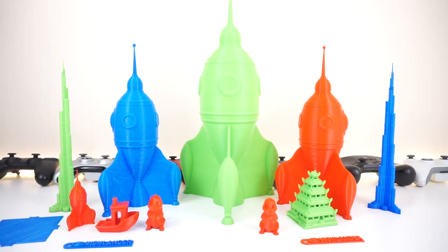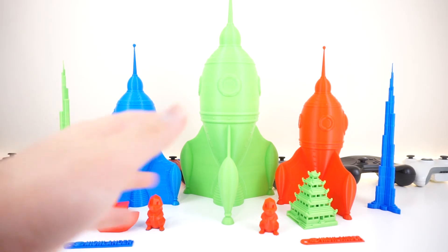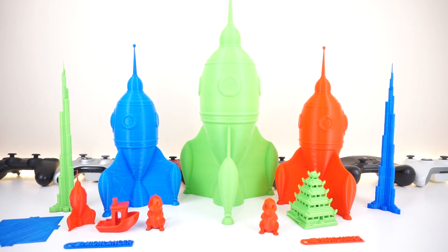The other issue I had was actually a worse problem — fixable by replacing a part and taking apart the control box. That is the control box slash power supply cooling fan. It seems like the fan they included for that box is defective. Sometimes when you turn it on, the fan isn't sitting in the right place and it would just spin and rattle and rattle until you turn it off, hit the box, and turn it back on. Then it gets a good spin and stays relatively quiet. But sometimes when you turn it on, you will hear it just rattling like crazy.